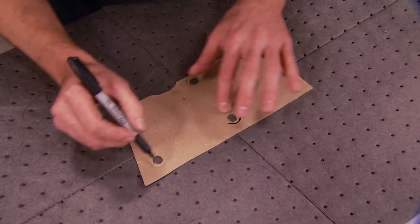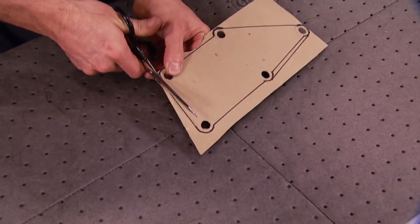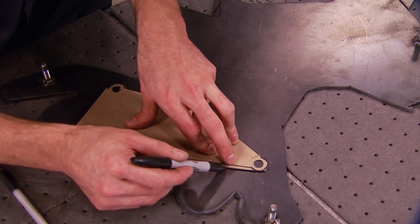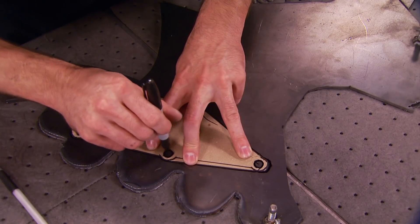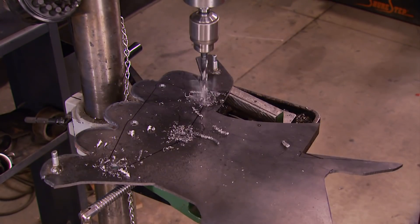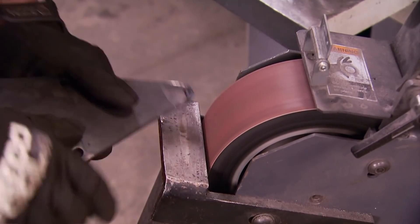Using the cuts in the cardboard as a guide, I'm going over things with a marker to more clearly define where I'm going to cut. You can make this plate as ornate or as simple as you want — as long as it holds the engine up, that's all that really matters. Now transfer this over to metal. Most of the lines connecting these bolt holes are pretty straight, but I did have to bring the top line in a little bit to clear a portion of the block. After marking our bolt holes, we went ahead and drilled all of them while it was still attached to the rest of the metal — drilling a large piece of metal is easier to hold onto than a small piece. After cutting it down on the bandsaw, a quick trip to the belt sander to finish things up.